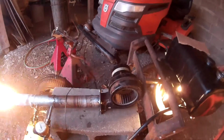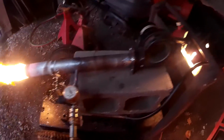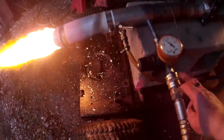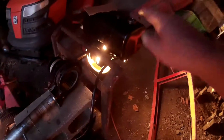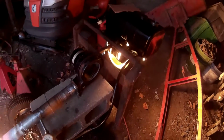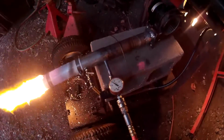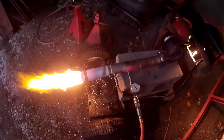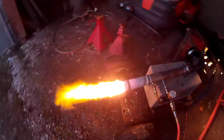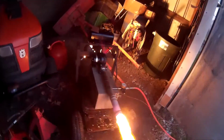See that the squirrel cage blower is not turned on. We have one fuel line, which is the waste vegetable oil coming from the fuel tank up there. And then this orange line is the air hose coming in from the regulator. So there is no other fuel. How I got it started, of course, I learned some stuff and made a few modifications.